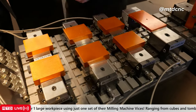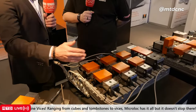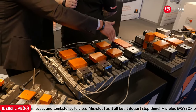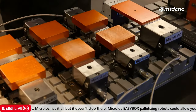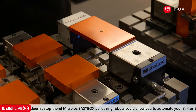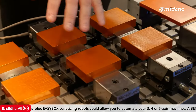What happens if I buy the smaller vise but then a big part comes through the door? Can I stack these? Exactly, and because you've got accuracy on the MicroLock base itself, you can clamp a very long part and you know that's going to be square and true to the fixed jaw. So it's completely flexible — you can move the fixed jaws to the back and use it to clamp very large parts as well. And in a normal vise you'd be doing one part at a time, but in this system you're running two every time.